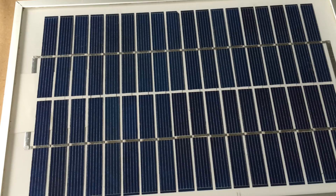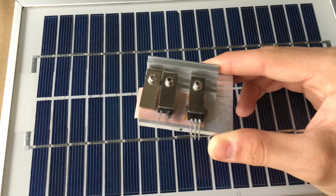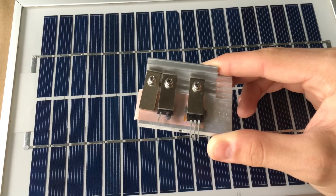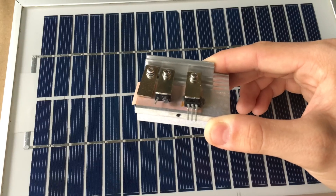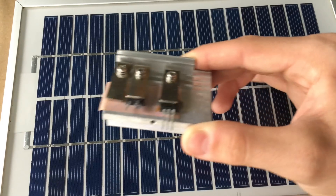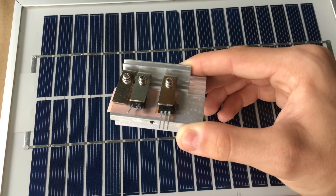So this project took me the better part of a month and a half from concept to completion, and that was mainly because I made a crucial mistake at the very beginning. I used one of these — an LM7805 linear 5-volt voltage regulator. I learned quickly that this linear regulator is not something you want to be using when you're trying to save power, especially with something like a solar panel.